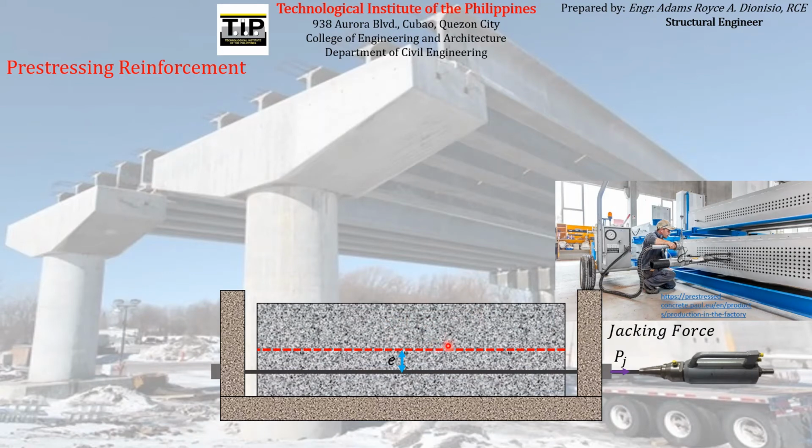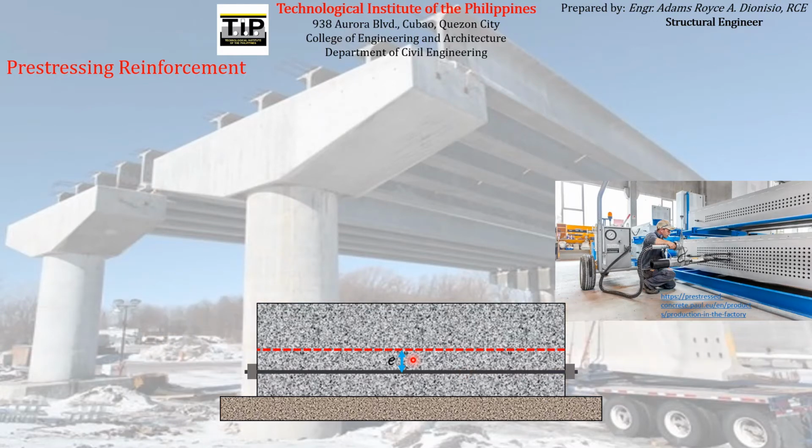into the formworks. And then after some time, when the concrete has achieved enough strength to resist that pre-stressing force or compressive force that will be applied by the pre-stressing reinforcement, the pre-stressing reinforcement will be cut. When the pre-stressing reinforcement is cut, since it is elastic, and since it elongated because of the pulling that the hydraulic jack imposed on it, the natural tendency of the pre-stressing reinforcement is to go back to its original length.